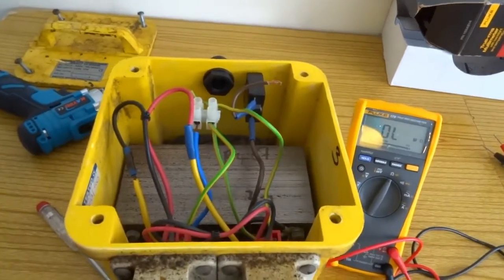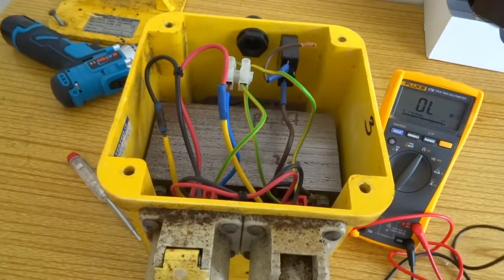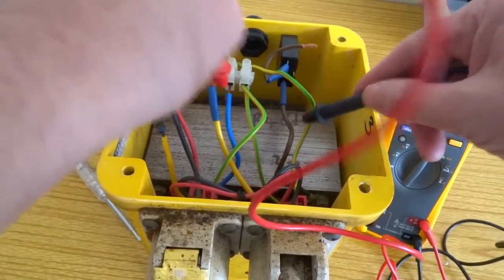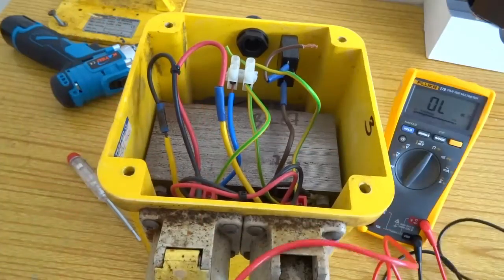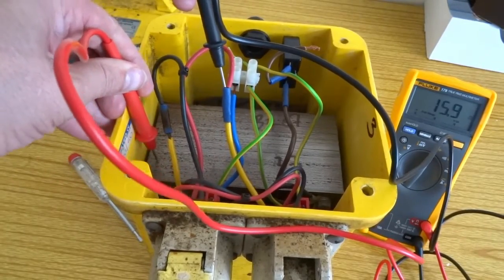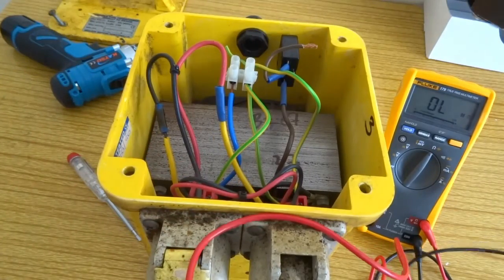Not a lot in them — it's a big transformer. Cut that switch, which I'll test now. Basically, find your primary windings — I'll do a test on that first. There's your primary incoming and this is your secondary — red and black there — so you can test them at these junction blocks. That's 0.3. Let's test it to earth as well, because each one of these is centre-tapped to earth for protection, so that only 55 volts is carried on each cable for safety, and then when they combine it's 110. So that's the secondary side fine.